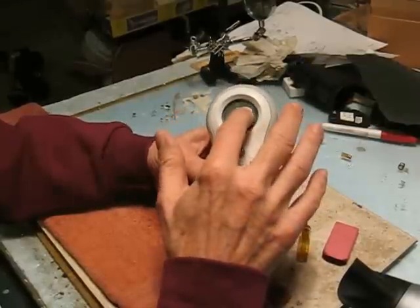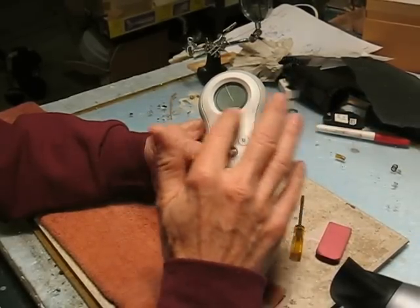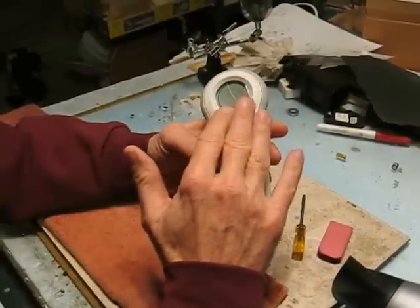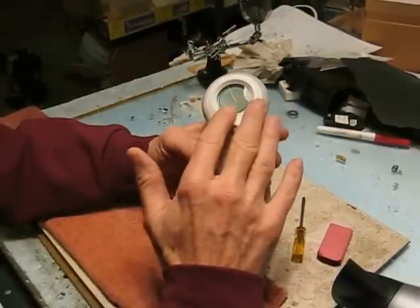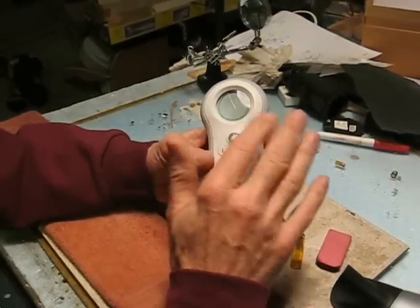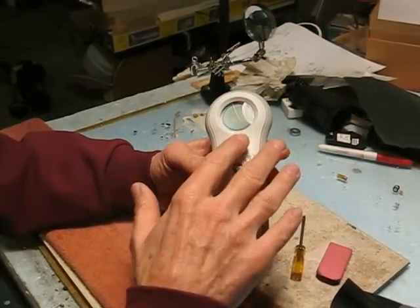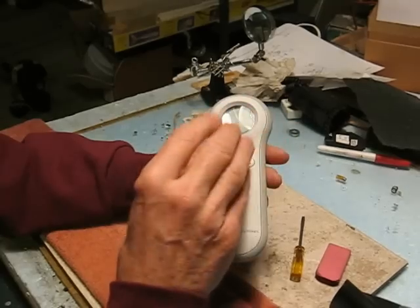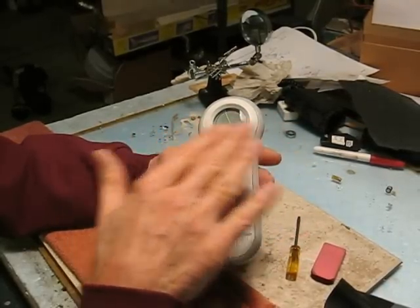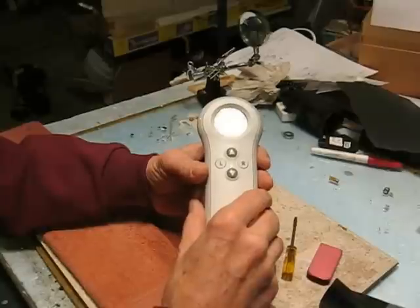Actually in here, this LCD, there's a cable that connects to it, and they apparently use some kind of glue to connect the cable to the LCD. Over time, that glue lets loose and it no longer is making a good connection, so that's why you lose parts of the numbers and eventually the whole thing. So what we need to do is open this up, go inside, heat up that glue to make it soft again, and then push it down so that the connections will be made again, and then the thing will be working. In our case, it got back to being just like new.